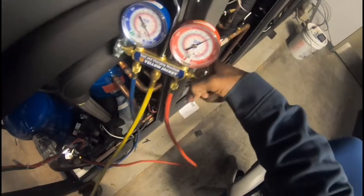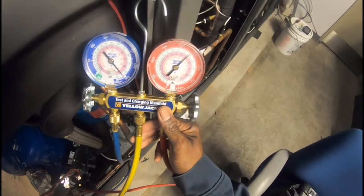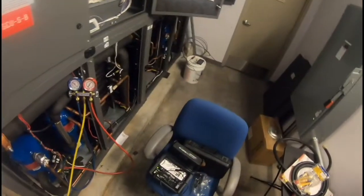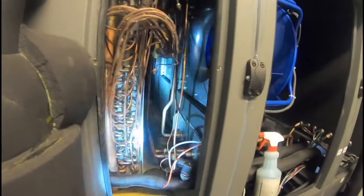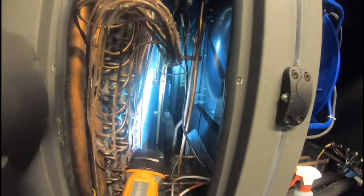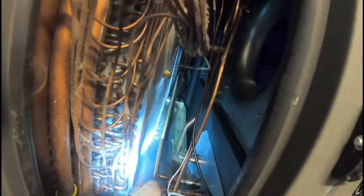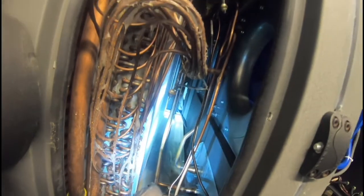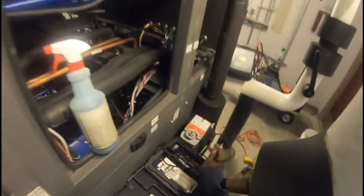It's up to about 475. Let's go over to where I know there's a leak that I need to fix. One of my leaks is located at that Schrader right there — the Schrader that connects liquid line to liquid line, number one system one, on the liquid side.